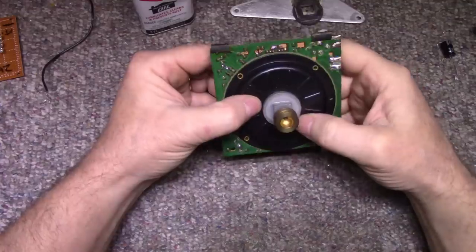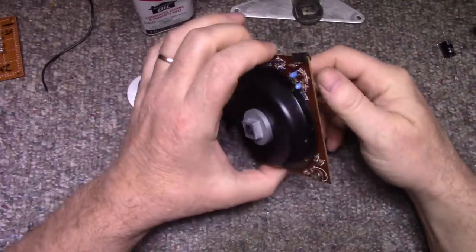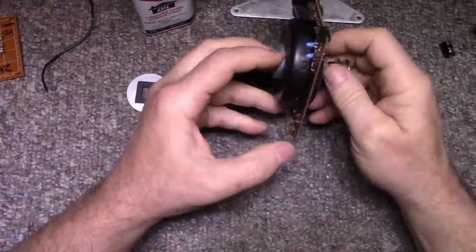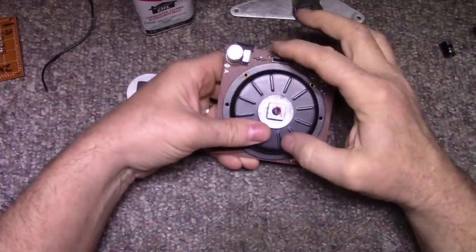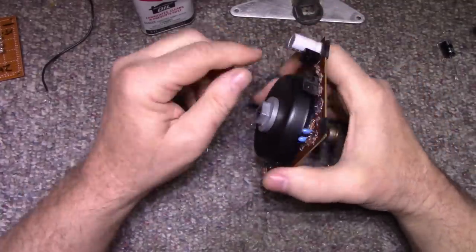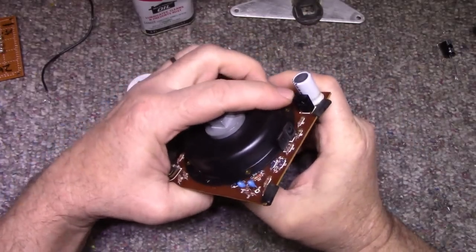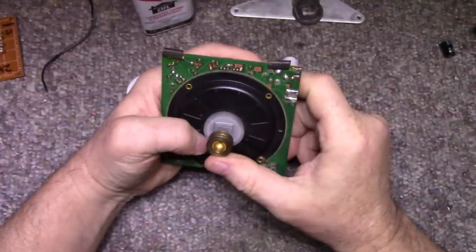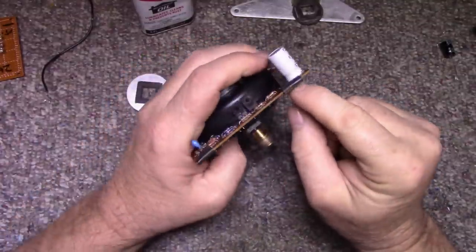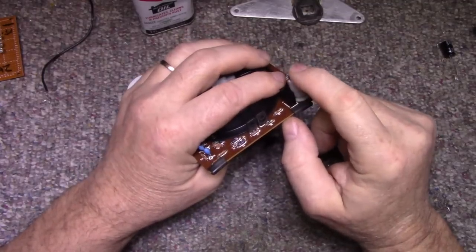What you're going to find in here is typically magnets and coils. That's pretty much all it is. And then there's going to be some form of feedback for the circuit. The electronic circuit here has a couple of transistors. I was wondering, what's this black box here? And I looked at it, and actually it's a bridge rectifier. Because what they're doing here is feeding AC in, it goes into this bridge rectifier, and then into this bulk capacitor, the power supply for this.